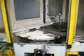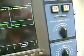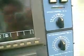Once you press the push buttons and do a pallet change, the machine starts to do a pallet change. If you put your hand across the light curtain, the process stops, a loud noise sounds, and a beacon light goes on indicating the pallet change was interrupted. So what the operator needs to do here, there's a reset button on the door, but first he needs to go into maintenance mode and disable the hydraulic turning two-way valve that does the rotation of the pallet changer.